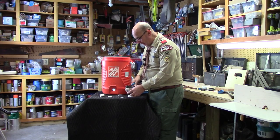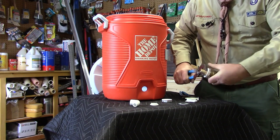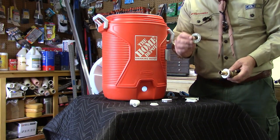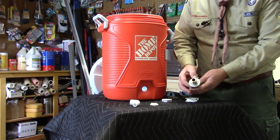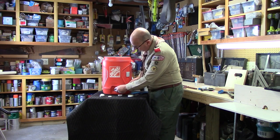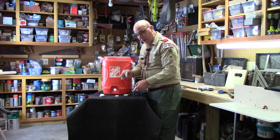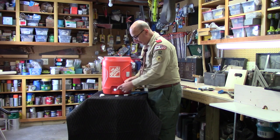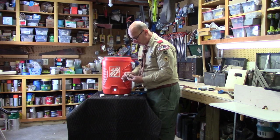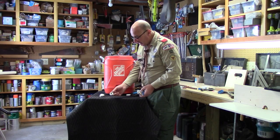Now I'll start with the valve on the opposite side of the arrow and tighten it on. With adjustable pliers, I can tighten down on the part of the nipple that doesn't have threads and tighten up the valve. With that tightened, I'll take the washer that came with one of the coupling nuts and put it onto the nipple so it rests up against the back of the coupling nut — this gives firmness when it rests against the cooler body. Before putting the valve assembly through the cooler, I'll put Teflon tape on the threads first, which is much easier to do beforehand.